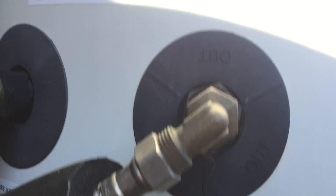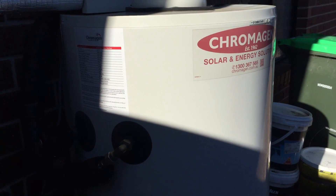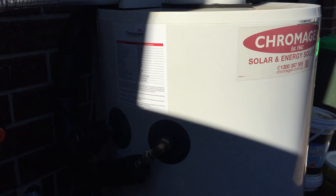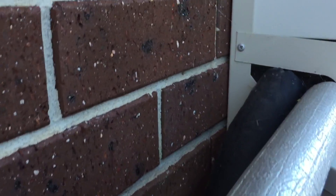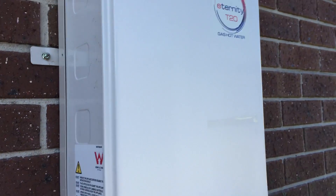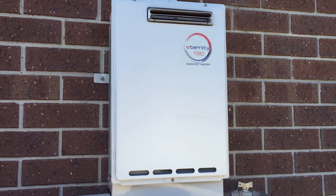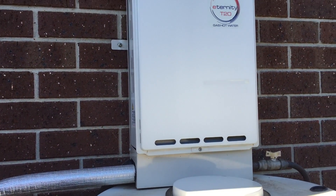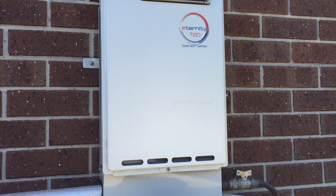So what this storage tank is all about - these are gas boosted. The solar does as much as it can to heat the water and will get that storage tank full of hot water, just like a gas would, but a gas would have a flame under it heating it up. Then when it comes out of the solar, it runs through that black pipe and it goes into what's called an instantaneous gas heater up on top. So this is not a gas storage hot water service where it fills up a big tank - this just heats the water as it passes through it, so it's only using the gas that you're actually using.